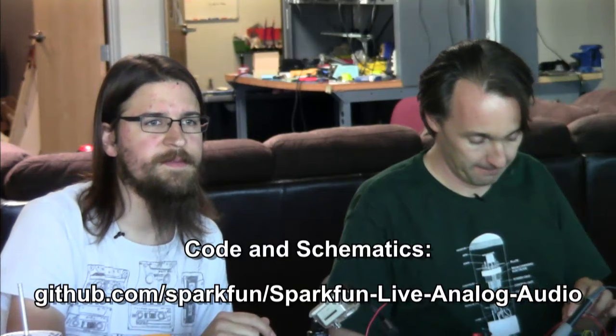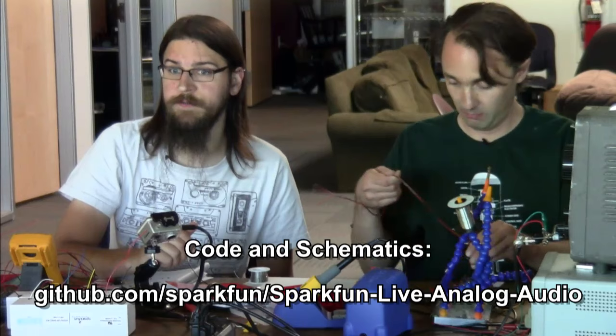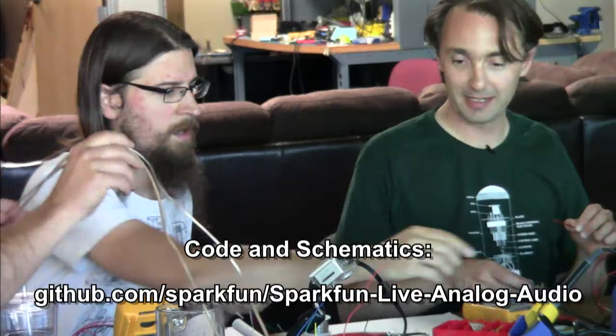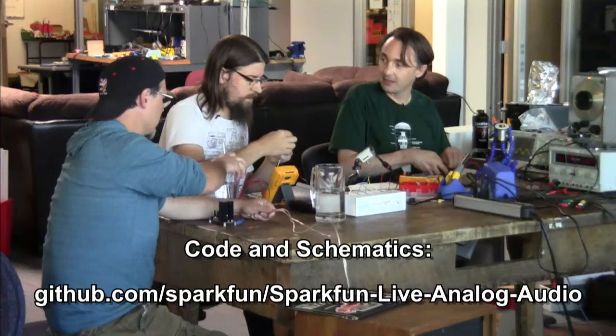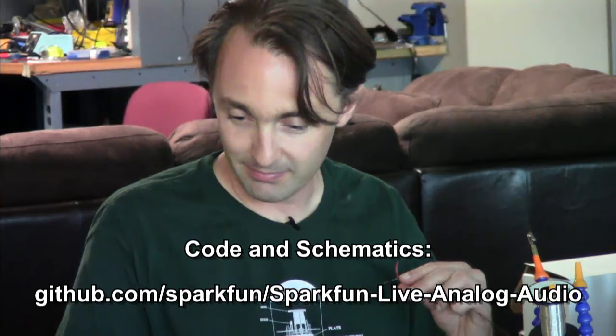Another thing, kind of related, in the GitHub there's also an example of just a single pole filter. If you go to LTspice and download their free tool, you can load that up and hit the simulate button, and it'll show you the frequency response. Then you can play around with the components and see how Spice works. It's like an endless toolbox of components. Even before you've purchased the parts, you can play around with them, figure out what they're doing, hopefully to inform you when you move to a physical design, and give you a better foundation as to how things work.